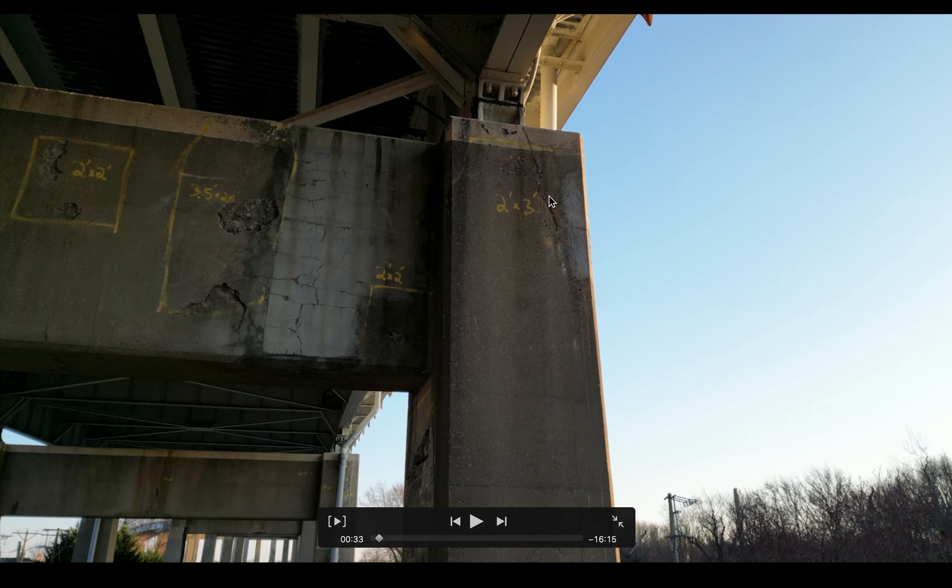Over here we have a significant-looking shear fracture coming down. There's overloading and shear fracturing on the south side of this column. Internally, this tie beam is able to resist the pressure of the outward force — imagine this sitting in sand and you're pushing down; it pushes out this way and that way. Over here, the loads are taken up in part by this tie beam. Over here it's stirrups only, and there is no counter pressure — just stirrups wrapping it.